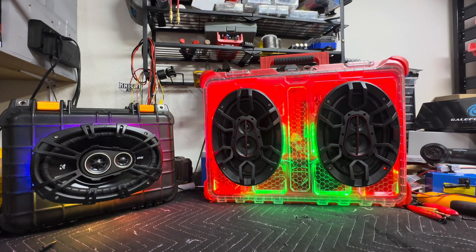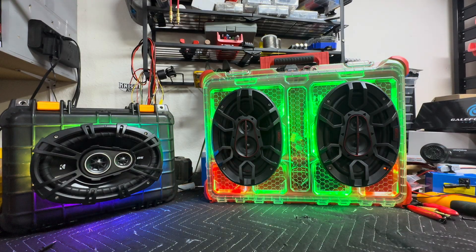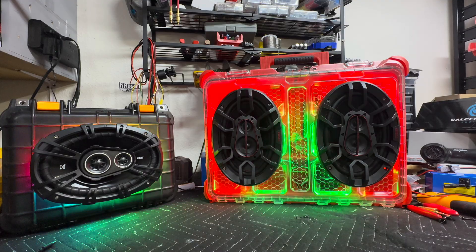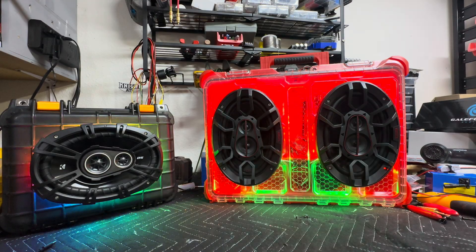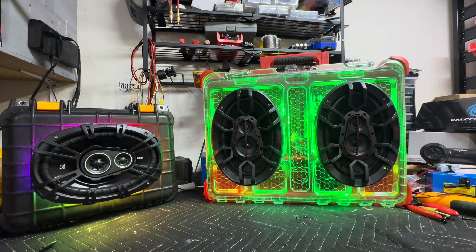There's even the tuning. If you have the bass higher than the treble, or if you have more bass in general, it's going to use up more — the amp's going to work harder and use up more of the battery capacity. It also depends on the battery size: you've got 2.6, 4, 5, 10, 20, 30 — it really depends on what battery you use.